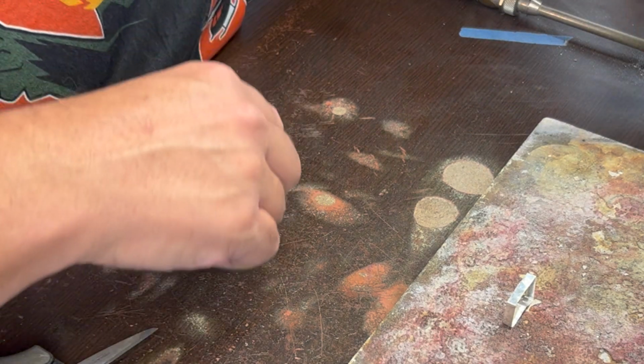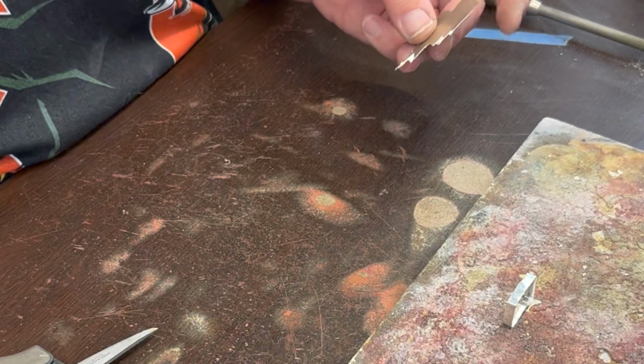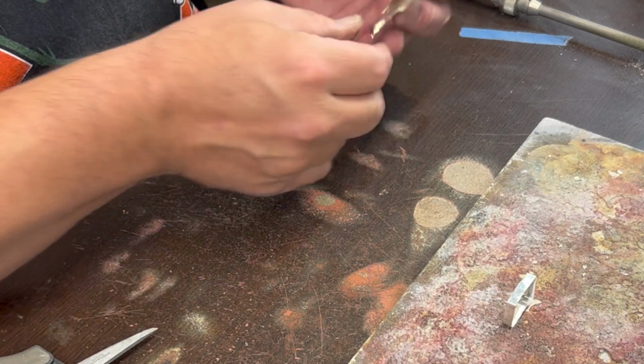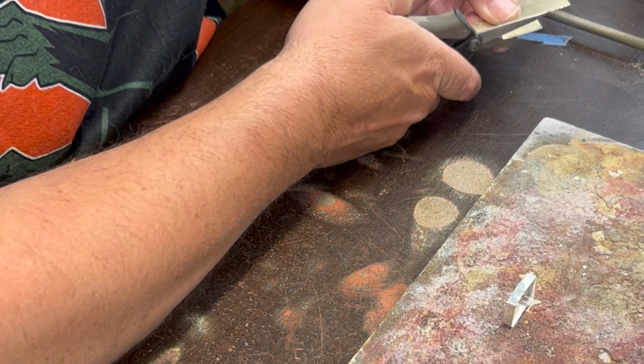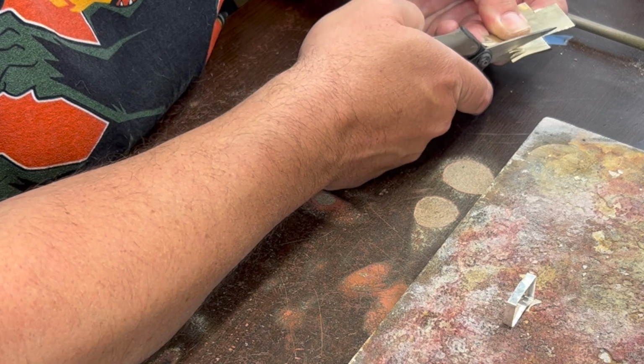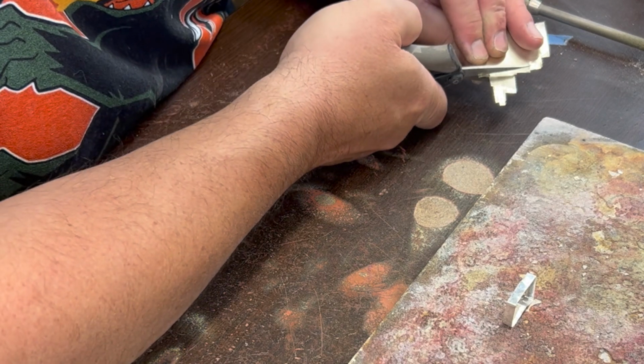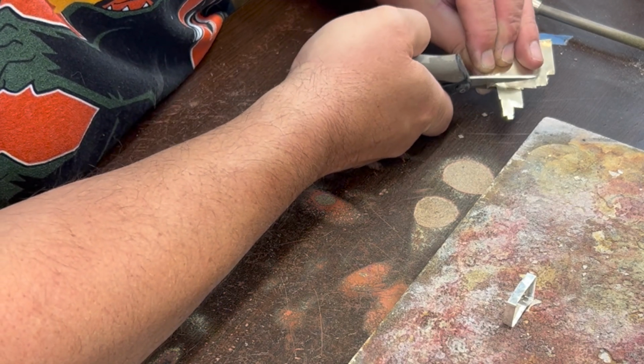Okay, so I always use hard silver solder and My-T-Flux from Rio Grande. It's a spray-on flux. Very rarely I will use a little bit of easy solder for when I'm a little concerned about something at the very end, but 99% of the time it's just hard silver solder for everything.